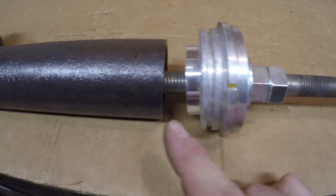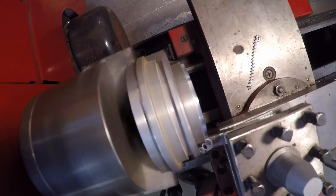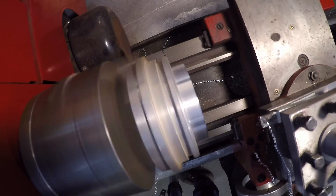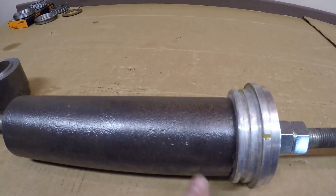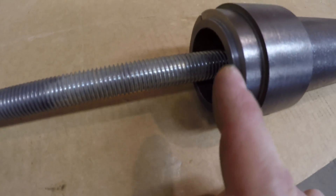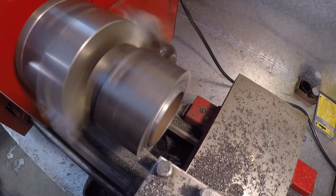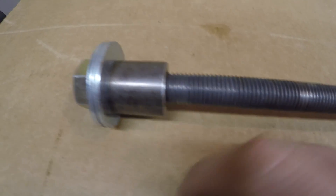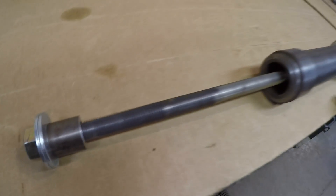Since I don't like hammering together press-fit components, I made a setup to press that front bearing on out of stuff I had laying around. I started with some three-quarter inch threaded rod double-nutted, with flat washers over the rod. I then turned down an aluminum disc to fit a piece of pipe — the pipe gets me out past the end of the top sliding gear shaft. Next I turned down an old cast iron hub to center itself inside the spacer pipe and press firmly on the inner race of that front bearing, finished off with a steel sleeve to protect the live power shaft bushing and center the threaded rod, plus a couple more flat washers and a nut on the end to pull it all together.